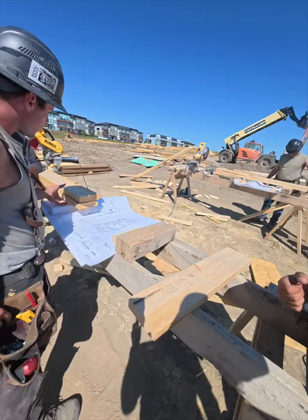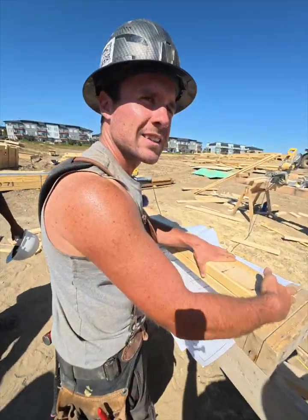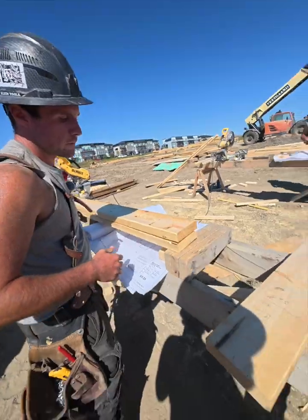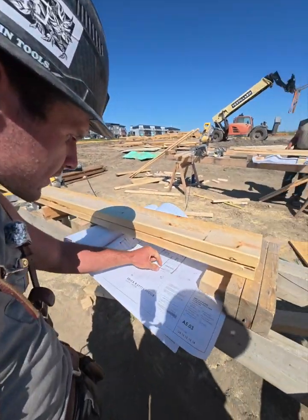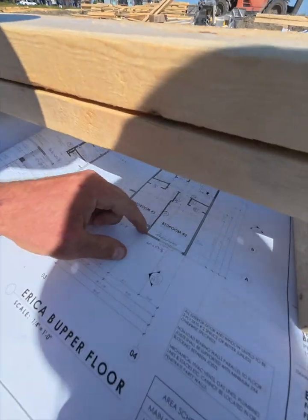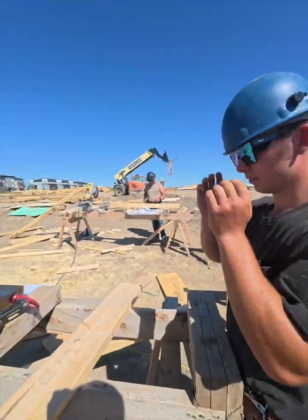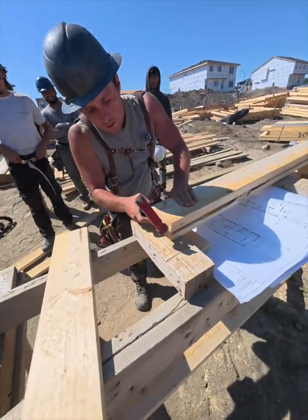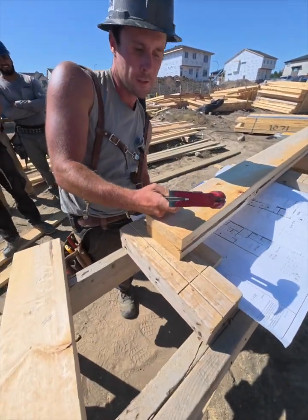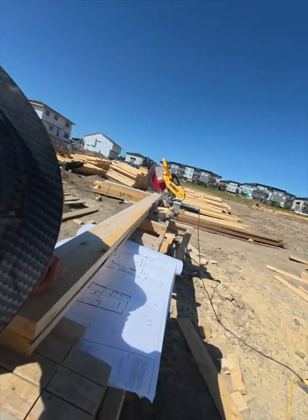We can cut that. Do you take some of it, just a shade smaller? I take a 1/16 off every time. If it's a little wall like this wall, this is like a 2'5" 5.5" wall, I'll just leave that exactly. So you just flush these up here, get it perfect, and then take a 2-inch nail, 2 1/4. Wane facing each other? Always wane together.